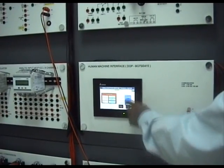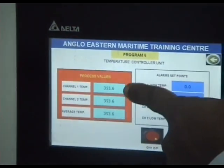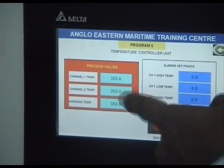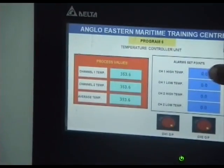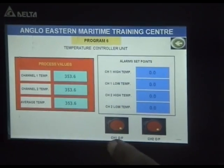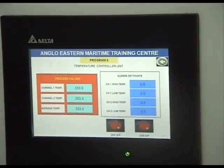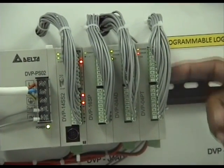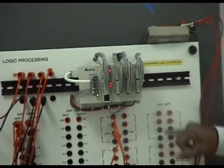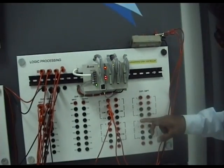We change to program 6. The HMI then displays channel 1 temperature, channel 2 temperature, and the average of the two channels. We can also show high and low temperature set points for channel 1 — these are user-inputable parameters — as well as high and low temperature for channel 2. Based on these comparisons, we can switch on Y0 or Y1 for channel 1 or channel 2 respectively. This is only an interface screen. The PT module is here, extended with terminals L+, L-, and I+ forming channel 1. FG stands for floating ground.